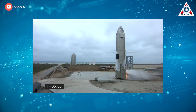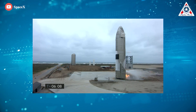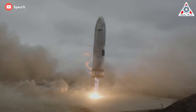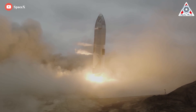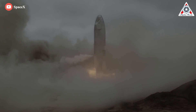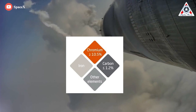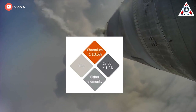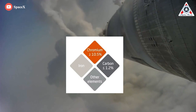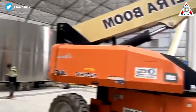What about 304L? At minus 196 degrees centigrade, which is close to the temperature of liquid oxygen, the 304L provides an additional 25% of toughness over the regular 304 steel. There is another advantage of 304L steel over 301 and 304, related to its low carbon content. When heated to high temperatures by welding, the chrome and carbon react to form areas that are more susceptible to both cracks and corrosion.